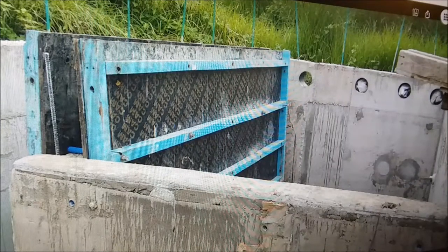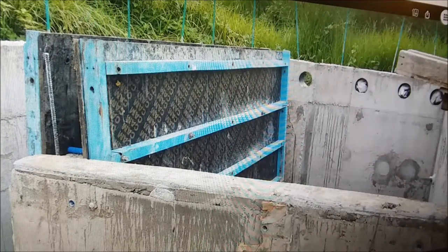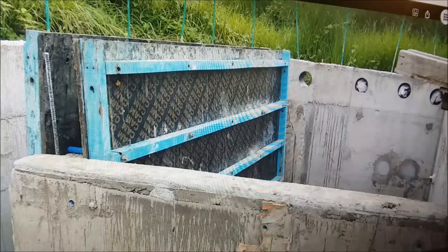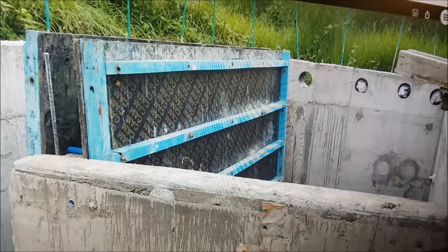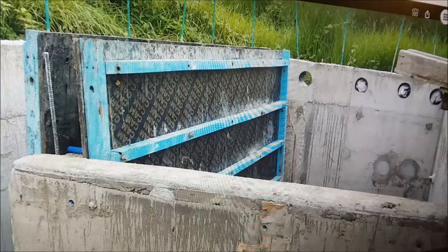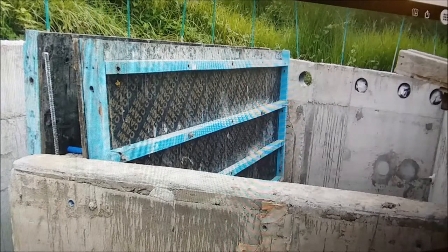Air space is supposed to be 25 percent of the height, so it's not as extreme as it seems. The form was slipped up by one bolt hole. They're going to pour a wall the same height as the rim of the septic tank — we don't want any foam from the floating skim to get over this wall into chambers three and four. This is the black water digester with enzymes in it, and we don't want that water getting into the later stages.